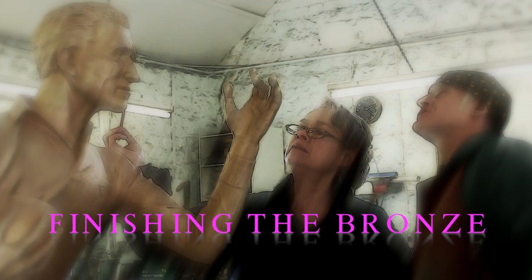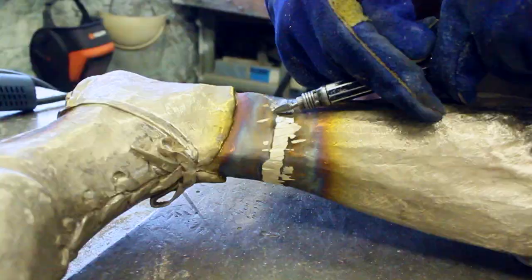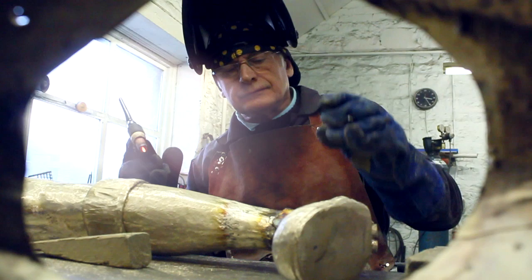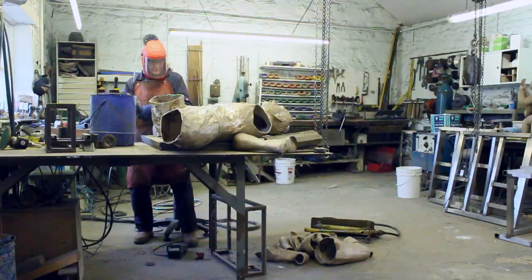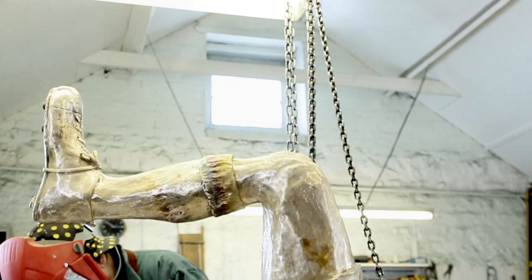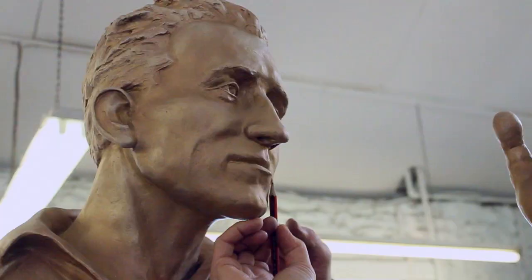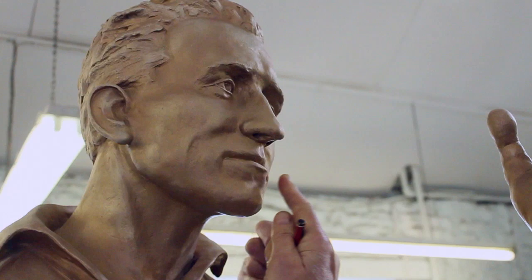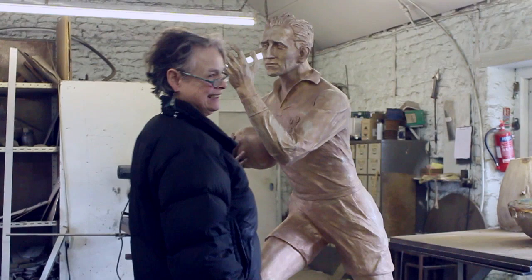When the individually cast pieces move into the metal part of the foundry, the idea is to weld all the pieces back together and clean up any seams in the metal and any little pitting that might have occurred from sand getting into the casting. The metal is worked, chiseled, chased, reassembled, and then sandblasted. Then I, as the artist, come back in and say over here a bit more smoothing, or could you get that little pockmark out — and so forth. Once I'm happy with it, it goes into the final stage, which is the patination.